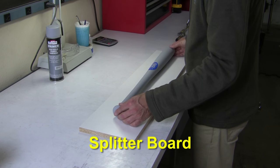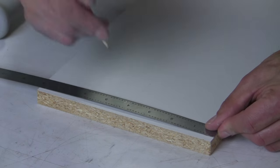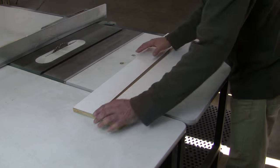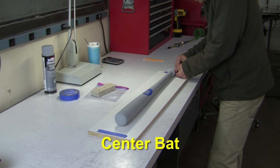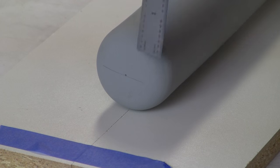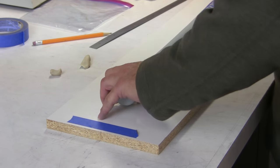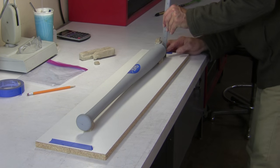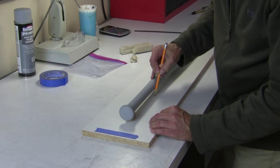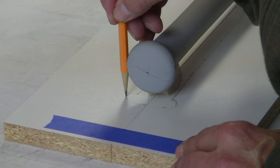Because we're going to make a two-piece mold, we'll first need to make our splitter board to divide our mold in two halves. To make cutting out the profile an easier process, we'll split our board into separate halves before tracing the bat's shape. With the boards taped together, we center the bat in the space, allowing enough area for our molding flanges and registration keys. Finding the center line of the bat at both ends will help us level and project the bat's correct shape onto the board. Our modeling clay holds the bat in place at the proper height. Begin tracing the profile of the bat onto the board — a square can assist plotting accurate marks. Being accurate here will save a lot of filing and sanding effort later, so take your time.